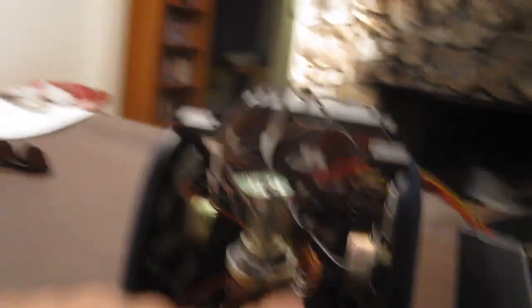What we're going to do is disrupt that beam and the focusing magnets. We're going to disconnect the speaker wires and run those speaker wires to the magnets that are controlling the ray, and see what happens with the picture. It should just be a dot, and then whatever noise comes across should adjust the beam — making something like an oscilloscope. Then secondly, we're going to bring the picture back in, hook the speaker wires back up, and see what happens. It should make a picture and also have a strange sound from the speakers that affects the picture.